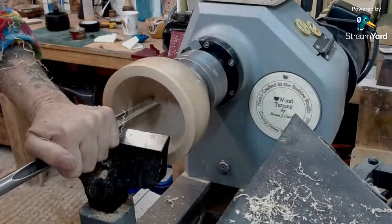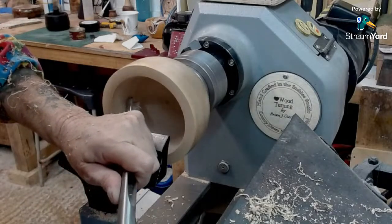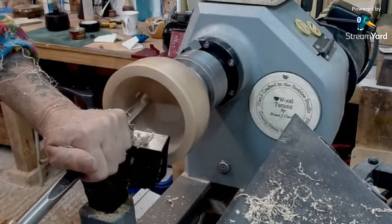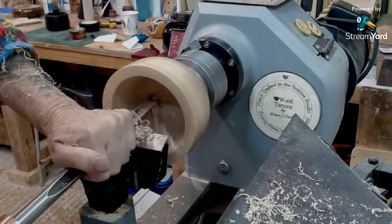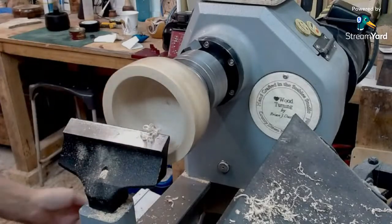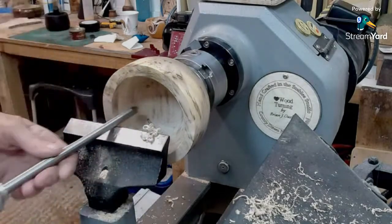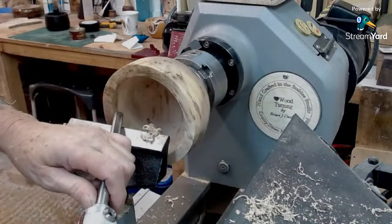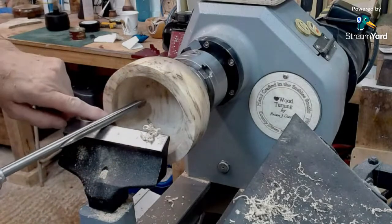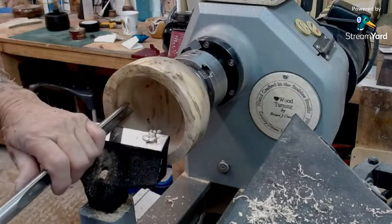I have to say, using this 60-degree bevel, it's good, isn't it? To go across the bottom is actually quite good. You want a fairly tight corner in there, and then just slide it across. I just think with a bowl that deep, and I might be wrong, you're going to start losing your bevel a bit on a 45-degree at that depth. That's absolutely the right idea. Because this is deep and steep-sided, as soon as you get down there and bring it across, you're bumping here and knocking the bevel off at the bottom. Whereas with a 60-degree, it'll just go straight to the bottom, see?